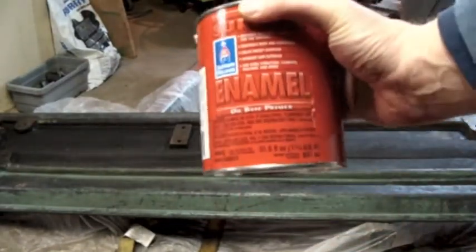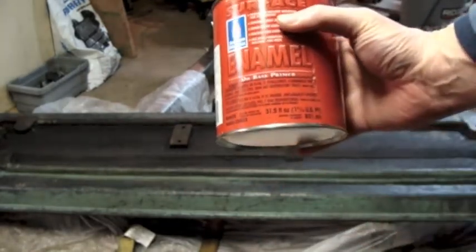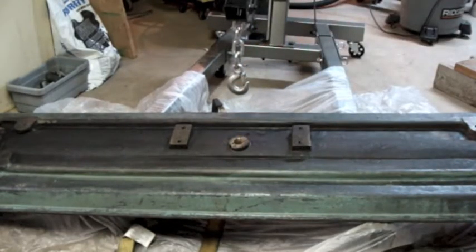Here's my choice of primer - going with the Sherwin-Williams. This is called the All-Surface Enamel Oil-Based Primer. It's rated to apply above 50 degrees. I'd actually like to be a little bit warmer in here - it's at 59 degrees, so that's going to have to suffice. Drying time at 77 degrees with 50% relative humidity is 20 minutes to touch and then an hour. With the lower temperature I have here, it's going to be a longer drying time, but that's not really going to be an issue because I'm basically just going to put one coat on tonight.